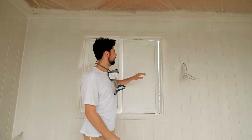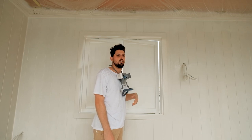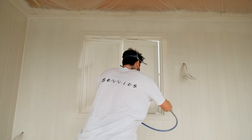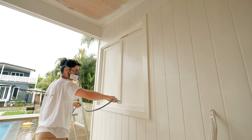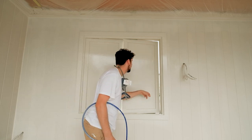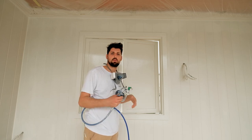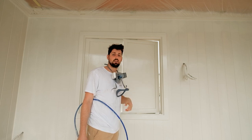As you can see there's a bit of overspray already just from the wall coat, which I wasn't being careful with, but now it's all being blended so I can just smash this coat out. I'll wait for the windows to dry and since everything's been first coated, we'll go over everything again. With the 210 and its narrow fan width, I have to do multiple passes for coverage, whereas a 310 with a 6-inch fan would be a bit wider. I'm starting to get a few runs — to counteract that I'll drop pressure a bit and move a tad faster. Just be mindful you don't have to cover everything 100% on first coat because you have second coat to come back for proper coverage.